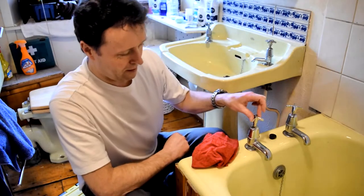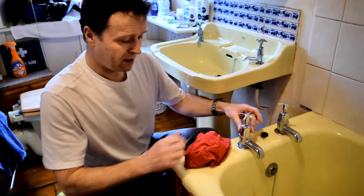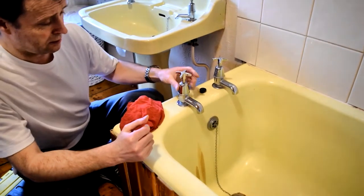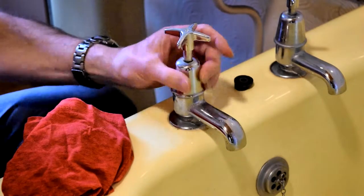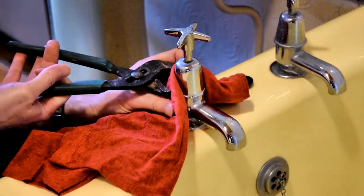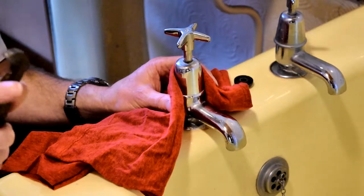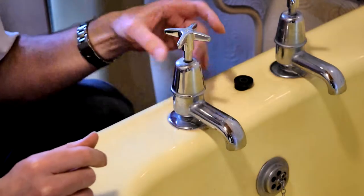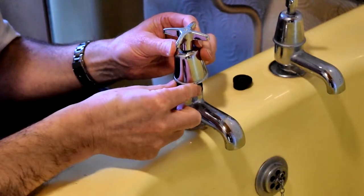Water's off, tap is turned on, no water's coming out — we're quite happy. These caps here — on more modern taps they just pull up, but on this age of tap it unscrews. If you're having difficulty unscrewing it, you can put a piece of cloth around it and then apply your grips to it. You do get grips with plastic inserts, but we're here to save money. So undo the cover, and what that gives us access to is a big brass bolt underneath, which holds the tap down into the chrome body.